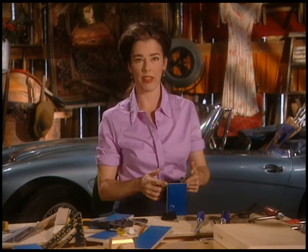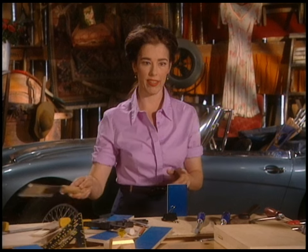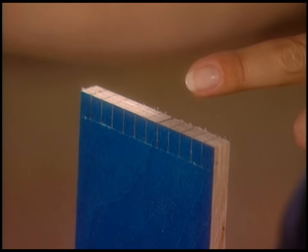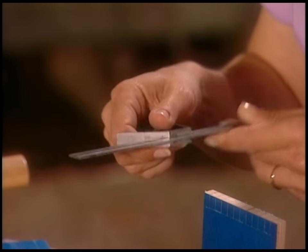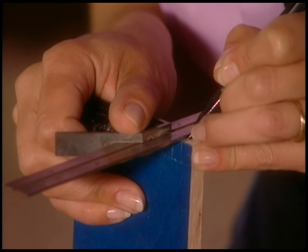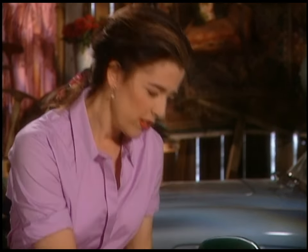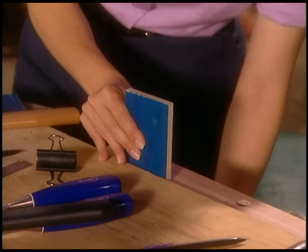I've made all the quarter-inch teeth marks. Now I'm going to saw down into those teeth marks, but I'm just going to be guessing across the top of the wood unless I've made a mark there also. If you have some kind of squaring device — this is a carpenter's tool called a tri-square — line up with the marks you've made for where the teeth are and make a line across the top. Set the board low because I want it to be fairly square and not going back and forth.